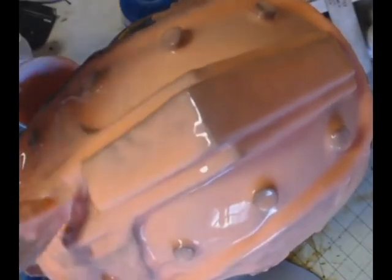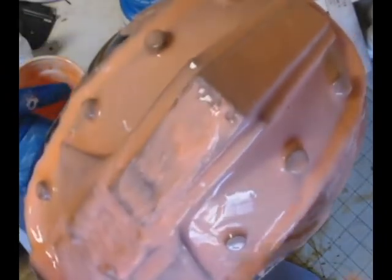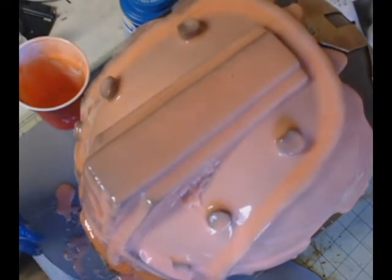So that's the great thing about brushable silicone. This Rebound 25 is a platinum cure silicone, and it's self-leveling. As those air bubbles pop, it takes care of refilling those areas. So you don't have to sit there and stress, brushing those little bits where air bubbles pop. You don't have to rebrush that whole area. And you can see there are still a few little ones there, but it's nothing major. They are popping on their own, and I might even help them a little bit in some areas.